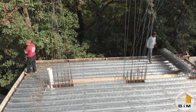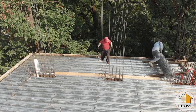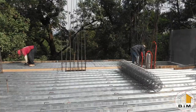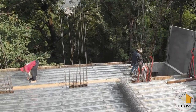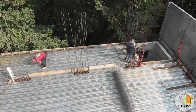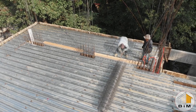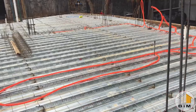They've finished installing the wood concrete forms around the entire perimeter, and we also have an additional concrete form that runs along the edge of those three rebar castillos. That's the concrete form for the drain that will protect the interior of the house from water being blown under the glass doors. The rains and winds get extremely heavy at times during the rainy season. Those drains in front of the door empty into the two PVC tubes — one on each end of that concrete form — and those tubes will continue up through the next floor and up onto the roof, where it will capture all the rainwater coming off the roof.